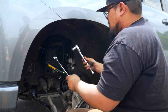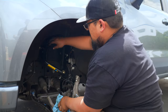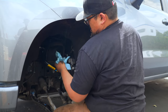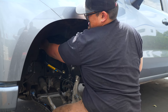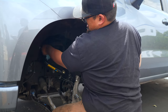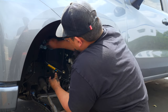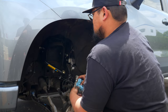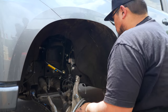When you get those bolts tightened down, some of that grease we squirted in earlier is going to want to squeeze out. Go ahead and take a towel and wipe off the excess. Too much grease isn't going to hurt you, but having too much will attract a little more dirt, and you don't want that — you want everything to look nice.